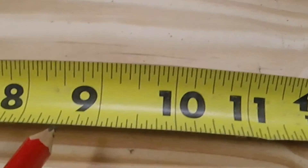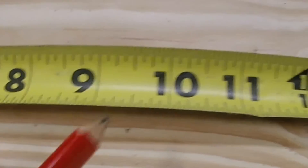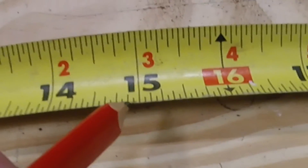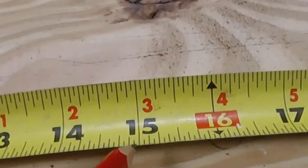That's really all there is to it. It does take a little bit of practice to actually master the tape measure — there are bunches of tips and tricks, and I can do more videos in the future if you guys like. Basically it just takes practice to get familiar with looking at any two points and knowing the distance. Each small mark is a sixteenth of an inch, and you should be able to pick any spot on the tape measure and know — that's seven-eighths, or fifteen-sixteenths. Once you get really familiar with that, you can count up or count down and make those installs a whole lot easier. Questions, comments, concerns — leave them in the comments below. Thanks for watching.